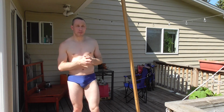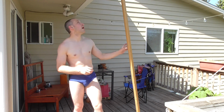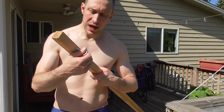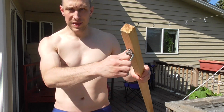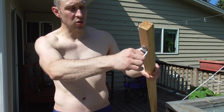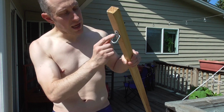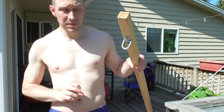So, guys, that's kind of the basics for this piece of equipment, which right now is going to be the most important one that we use. Now, I did get this out of Home Depot. Again, I know I already talked about mounting brackets. This guy is kind of okay. What I don't like about it, besides that there's no lateral support, so if I pull on it this way, there's not a lot of lateral support. It's just whatever the screws are holding. So if you have that up into your ceiling in 2x4, you might have some issues that come up along with this. And if I remember correctly, this guy is welded in the middle where this ring comes together. Welds can fail.